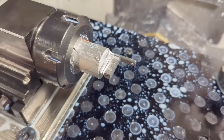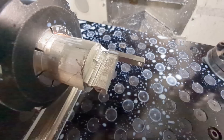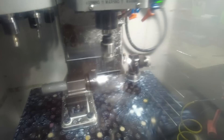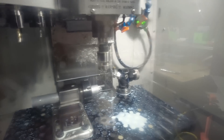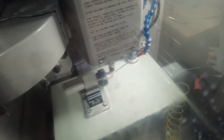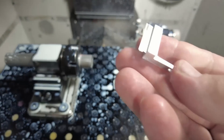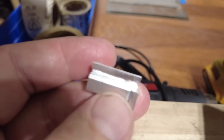Yeah, this right here is where that long tool was cutting and those finishes are not good — I'll have to do something about that. There is our finished part. I haven't measured it yet but it doesn't look terrible except for that place I mentioned. On the actual parts I'll just sand off the tab on the back; that's not hard.